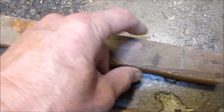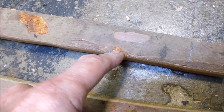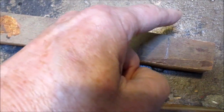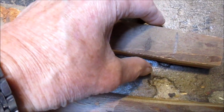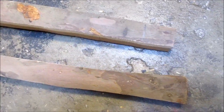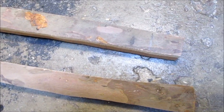Now, one of the things to note, this billet's just about wide enough. So if I mark out my Zed Splice, we'll be fine. An easy mistake to make is if you've got a nice chunky wide billet, say this wide, you mark out your Z using the full width, but then by the time the bow is reduced in width, a lot has disappeared off the sides of your splice and you've got a lot less glue line than you thought you had. I'll show you that a bit more when I draw it up on a bit of paper first, just to give a clearer idea. So we'll run through it on paper and then we'll do it for real.